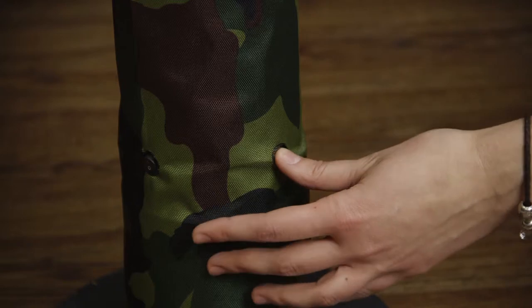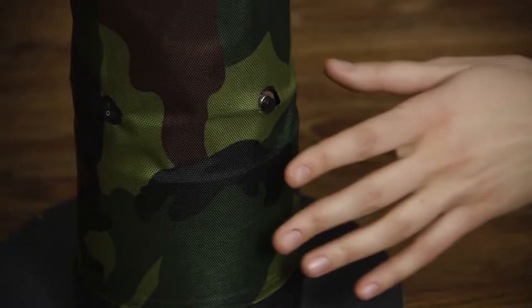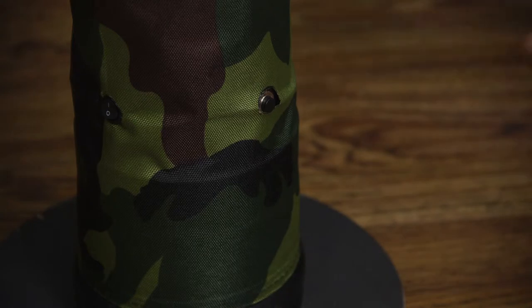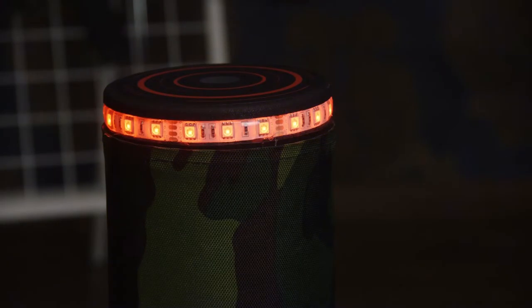The round time is very easy to adjust. Press the administrator button on the device and turn the device on — the control point goes into programming mode. By pressing the button we adjust the round time by plus one point. Do not forget to set the changes by holding down the administrator button once again.